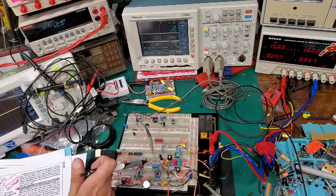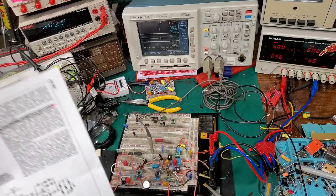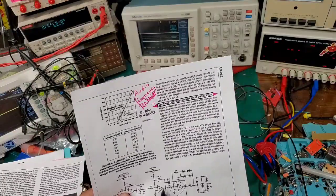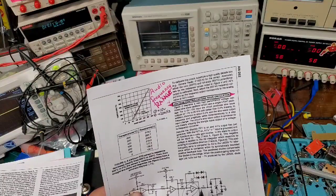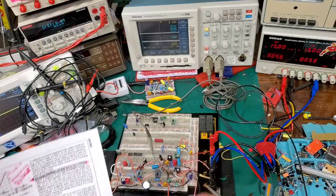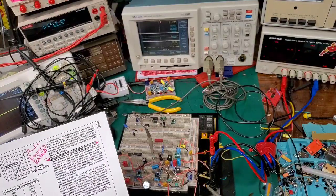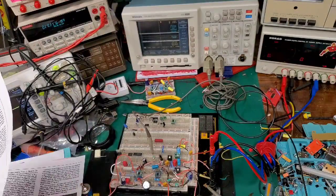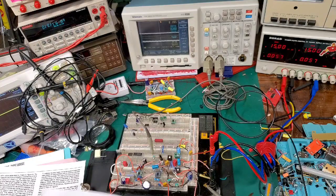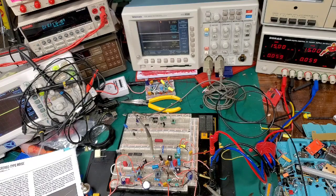I had to change the values of the capacitors for A3 and the feed forward to A3. When I was using BJTs, I had to lower that and raise that. So I pretty much had them the same. But when I was looking at the timing of all of them, I don't know. This isn't as vital as the 1 megahertz VCO that he makes in the Linear Technology App Notes book. So, since it really didn't matter, I don't care too much about the distortion that's being thrown out. I just went with it.